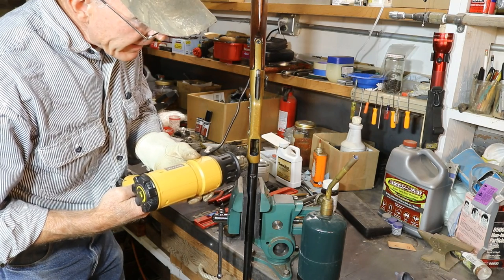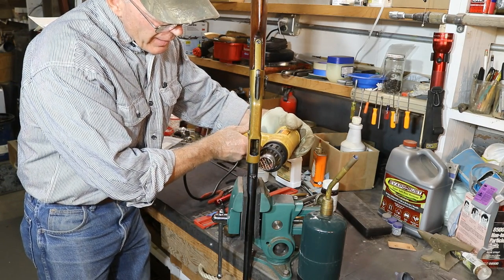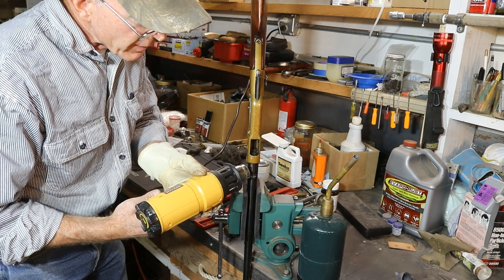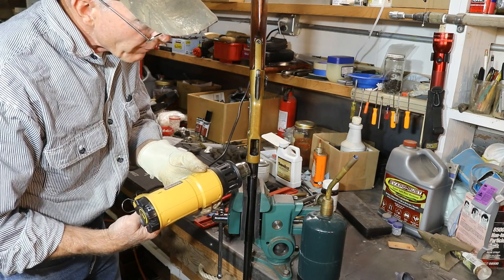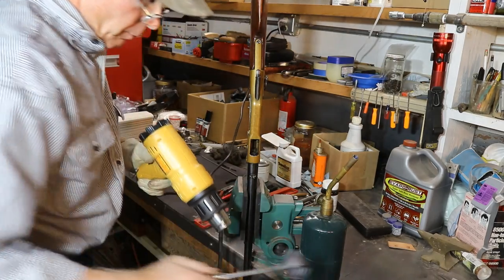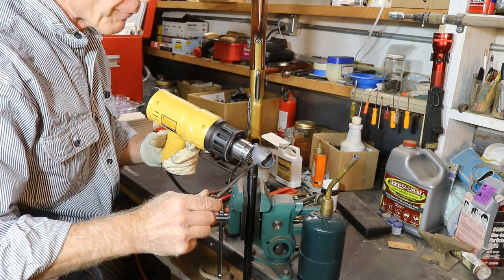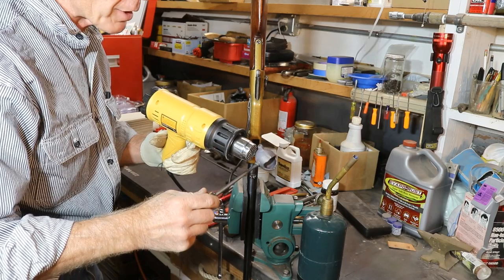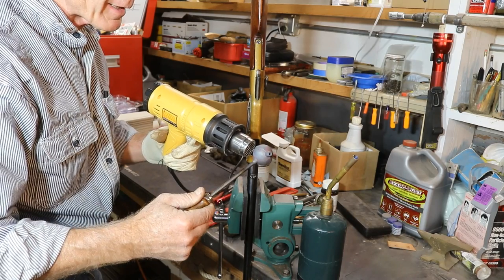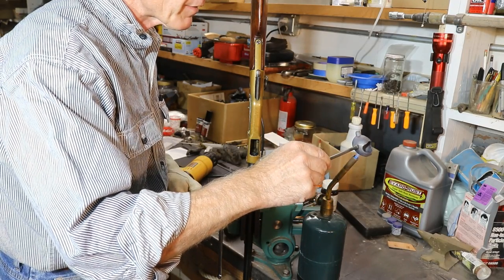We're putting a little heat into this chamber, getting it preheated. For those of you who are bullet casters, you know we don't drop good bullets until we've heated up our mold. We're not going to get this super hot because our alloy isn't going to get that hot — it'll probably fold over a little bit, but we'll make a good enough mold to get some measurements. We'll heat up the ladle too, get it preheated. We took the forend off just so we wouldn't cause any damage to the finish. If you're using a torch to preheat your chamber, definitely don't get it near the forend.